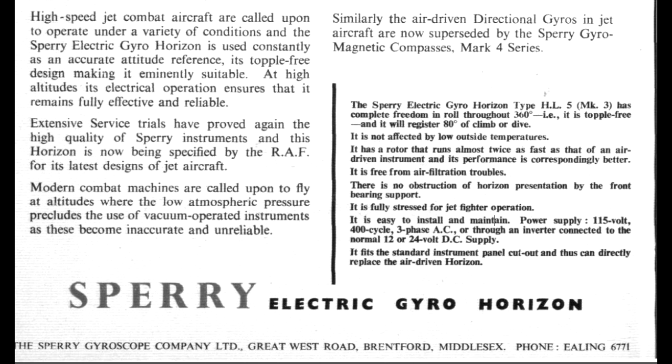I'm probably going to need a much chunkier amplifier to get that. The way I'd probably attempt to do that is to take an audio amplifier and then stick it through a mains transformer wired backwards to get a higher voltage supply. But this amplifier is just too unstable to do that. If I can find another amplifier, I might have a go at seeing if I can crank it up to full speed at some point.